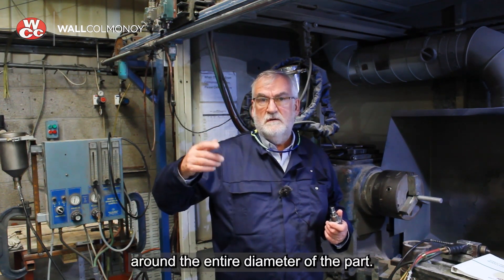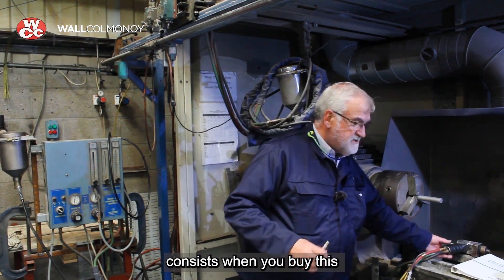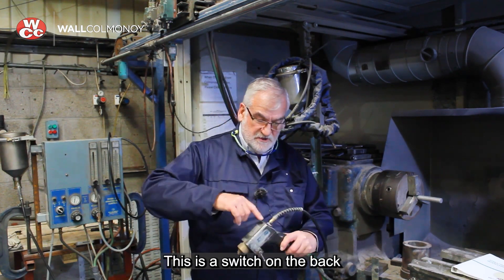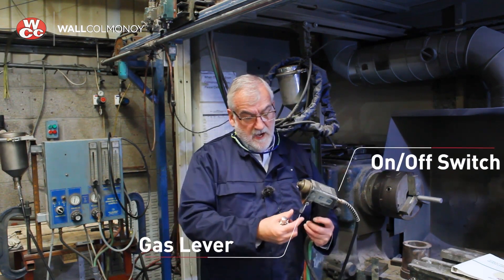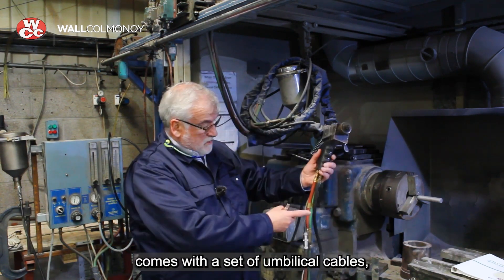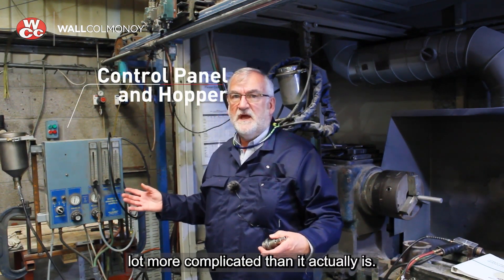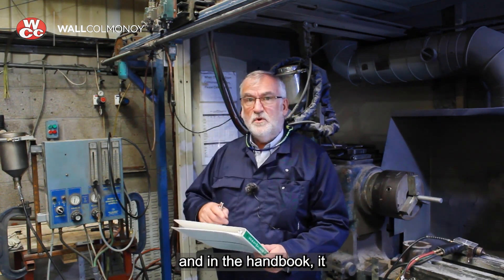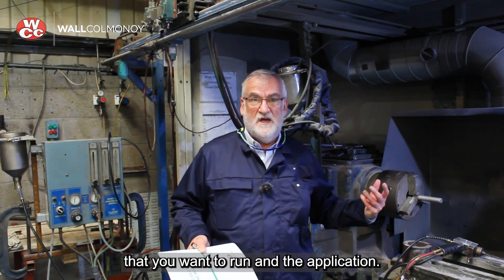If you're doing these parts or other rotating parts — shafts from motors, fans, seal areas — and the part is circular, the optimized way of applying a very good fused coating is with the spray welder. That way you get a very dense, concise, consistent coating around the entire diameter of the part. The spray welder consists, when you buy it as a kit, of a torch — there's a switch on the back and a lever on the front. The switch literally turns the powder on and off, and the lever turns the gases on and off for the combustion part.